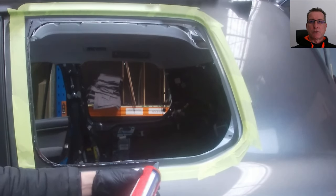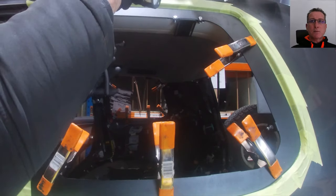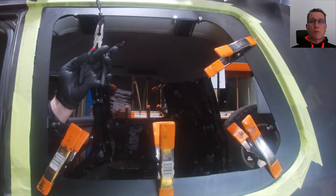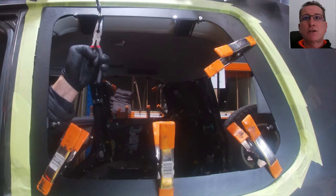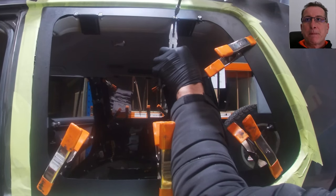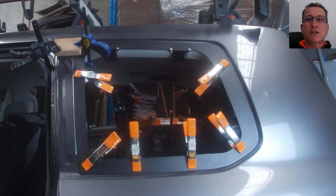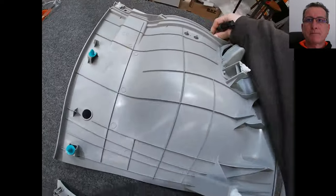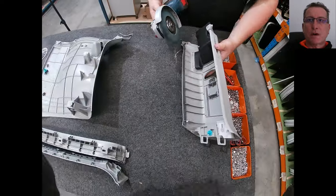There's a lot more room for the glue to spread around the corners. Now once the glue is all done, we've got the frame in place. As we can't get clamps on the top — you can see the interior trim's back in place — we're just tightening up these screws, not too much; we don't want to squeeze all the glue out, we just want to ensure a good bond. We will tighten them up later in the process. Just tightening the frame to the support brackets and pulling it back onto the glue. Apply clamps in that top corner just to pull it right in — this helps with door placement later on. Now we can go along and get all the other trims cut and ready for installation while the glue's drying.